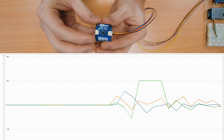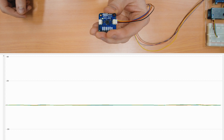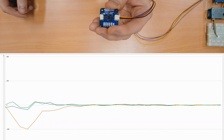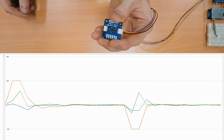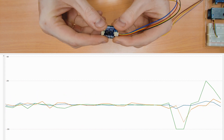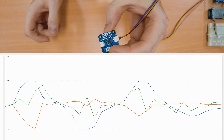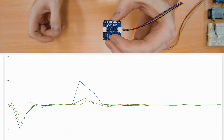Now we're looking at the gyro's measurement. This is measuring the angle rate in degrees per second, so if I roll this way that should be a positive y because this is the y-axis and the right-hand rule means this is positive. I can get that spike and likewise when I roll back we get the negative, and the same for the other axes. This would be in the x direction and in the z direction if I twist it this way. You can see on the graph there's a bit of cross coupling there because I can't really rotate this across just one axis very easily, but you get the point.